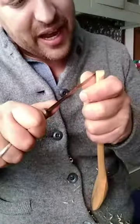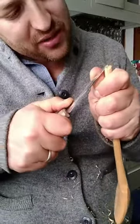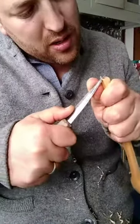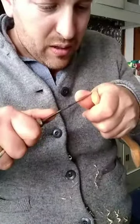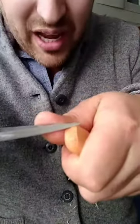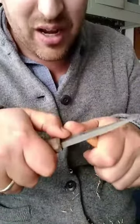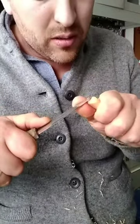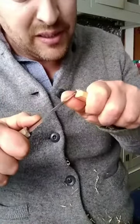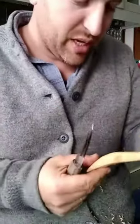So now I'm going to do the handle end again, and then I'm going to move on to doing the bowls. Does anyone have any questions about facets on the handles before I move on to bowls? And again, using the tip of the knife, I find really helpful here because I can see right behind the tip of the knife exactly what I did. And that helps me adjust what I'm doing in the moment. Whereas if you use back here, the knife hides what you've done and you can't adjust in the same way. So I do a lot of work with just the tip of the knife. Which means that when you sharpen your knives, you have to be very fastidious about making sure that the tip is really well sharpened, which is tricky.